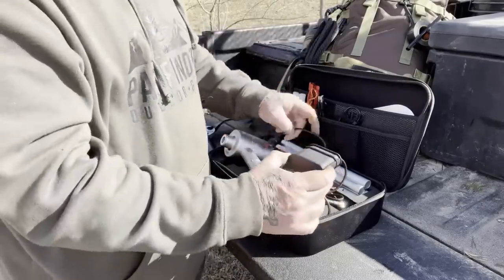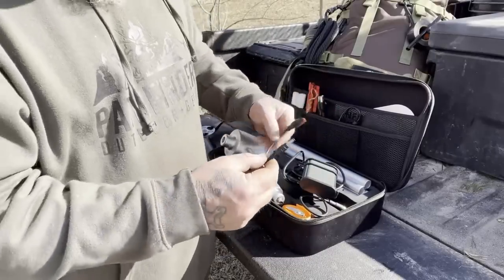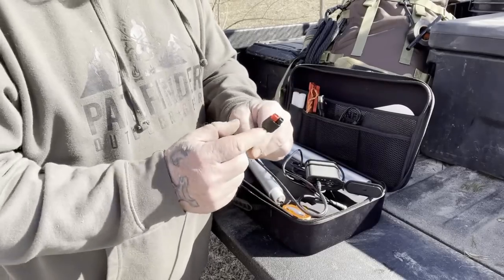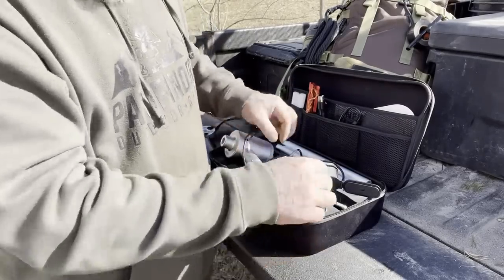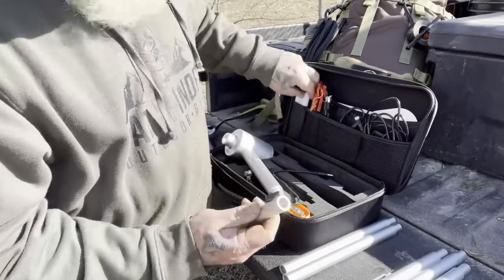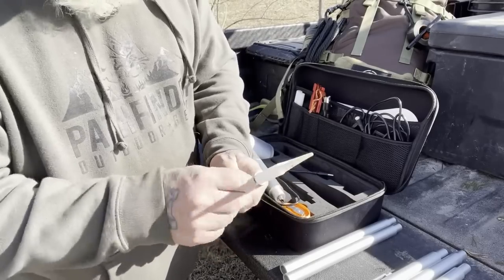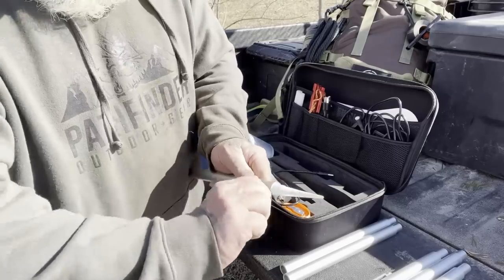So what I did was I changed this one connector that came with it so that I could plug it into a 12-volt outlet and charge a 12-volt Bioenno battery with an Anderson Powerpole for things like radio. Each of these three legs has a screw on the bottom to put a stake, or a ground peg, into for the tripod itself. You just unscrew that until you get it inside and screw it down.